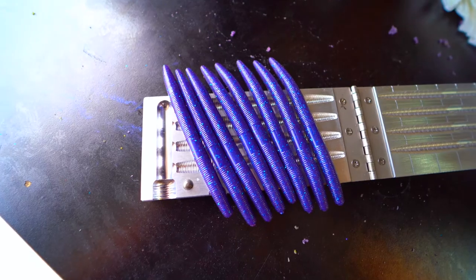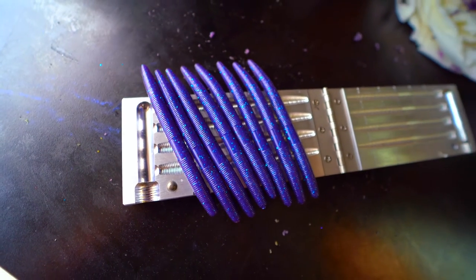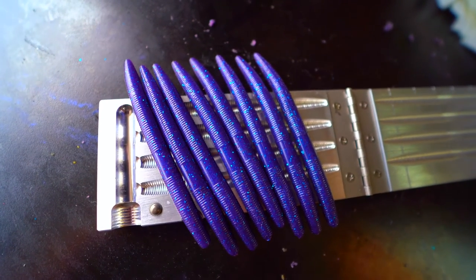There you have it — there's our finished baits right there. Really cool color. Definitely a color match failure, though. When I'm going for that purple, these did not turn out purple. One tip before we go: when you're using this mold, make sure to pour your plastic hot. When I wasn't pouring it hot enough, it was starting to dimple a little bit. Pour that plastic hot and you'll get a lot better fill — the mold just works better that way. If you guys go and buy any products from Do-It Molds, please use my affiliate link — it's really important and it's just a way so they can track sales coming from my content. Hope you guys enjoyed watching today's video. Definitely turned out a cool color, but definitely a color match failure. That might be the name of the video — but still a cool color, still going to be catching fish on those baits. See you guys next time.